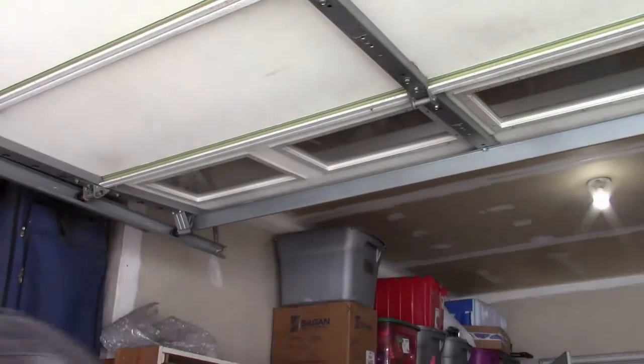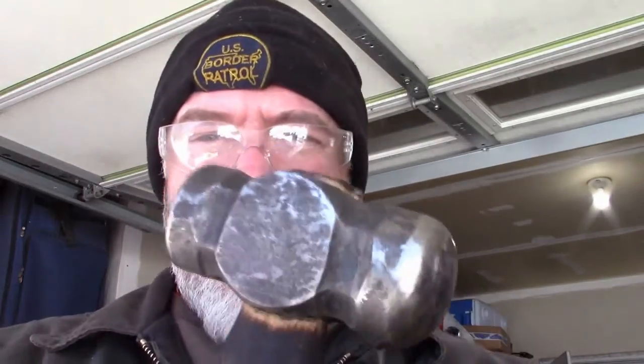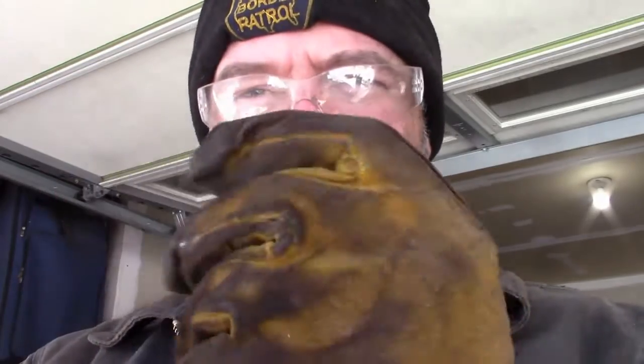So I'm doing a rounding hammer for Heath here, and I don't have a cupping tool. Don't have any plans to make a cupping tool, so I'm going to have to try to dress the faces the best I can at the anvil and then grind them. You know, this one I made at Dave's house, he didn't have a cupping tool either, and I just ground them all in. That took a while, so I'm going to try and shape some of it by hand here.